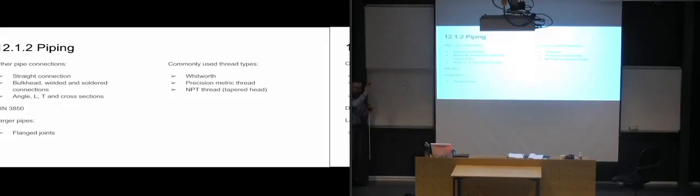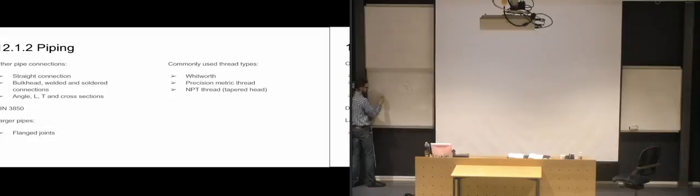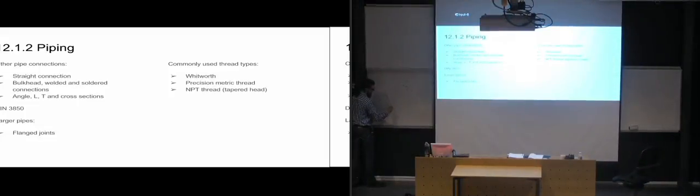So if we cut along the length of a bolt so that we can look at the thread itself, we're going to see that it's basically shaped out of triangles. So we could extend this and get sharp points. The only reason why there isn't sharp points on the threads is basically being able to cut a sharp point into the material. That's very difficult. So it's easier to have a flat section at the end there when you're cutting it.